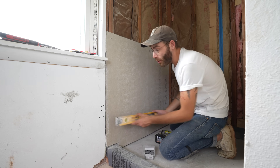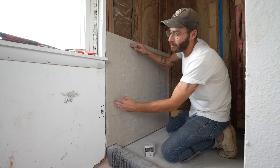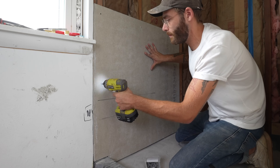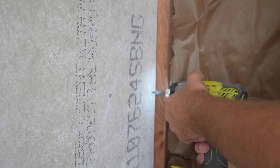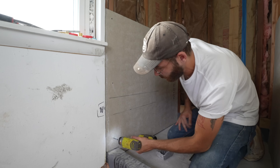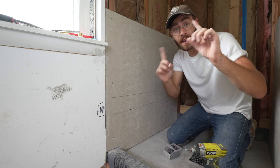Before we get too far into it, I'm going to extend a line where I've got wires and nail plates covering the stud. It's best to space these rows about 12 inches — I'm going to do three rows, which is pretty close to that. Be careful you don't over-torque these screws. The screw should stop when it's flush with the surface of your cement board; you don't want it to recess into it. Pretty much follow the same rules as drywall. It's also a bad idea to install the bottom row of screws too low because you don't want to puncture the pan liner where there might be standing water.